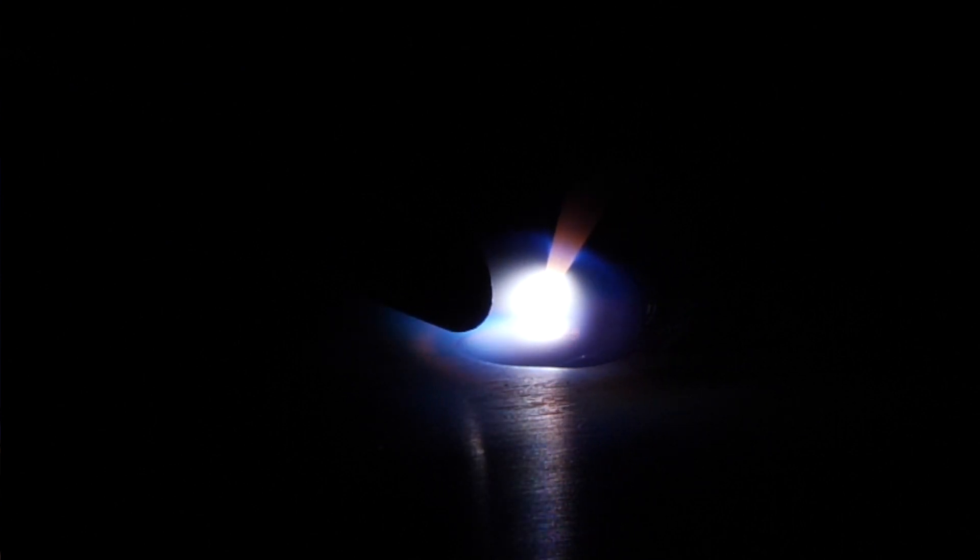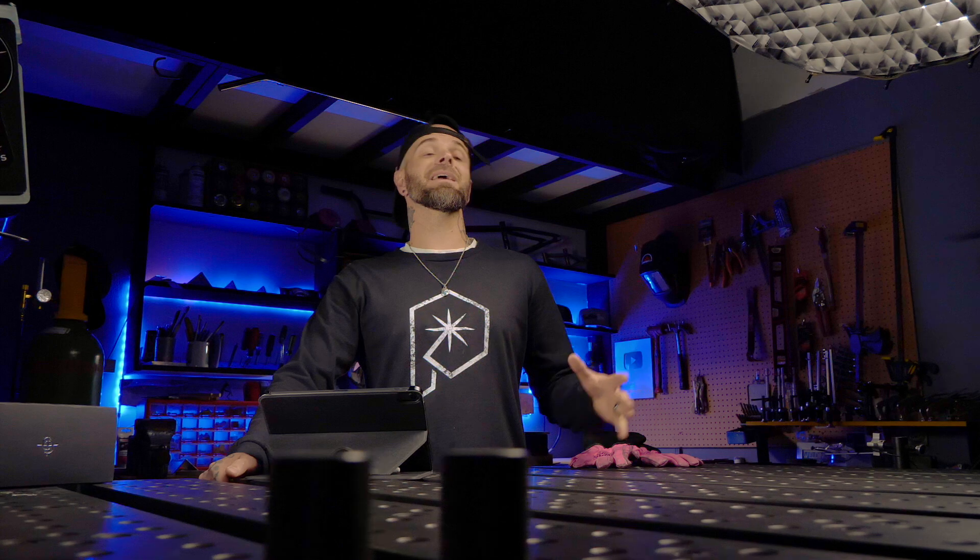If I take a few extra seconds for things to stabilize, but then once everything is good, I am good to go. What is typical is somebody's going to start up their pass, experience a little bit of turbulence, and the puddle is going to be wobbling all over the place. What is happening here is that this is a puddle that has not established properly before somebody tries to start moving it. All it takes is a little bit of extra time at the beginning and attention to detail — we want to make sure that the filler material settles down completely and the profile is exactly the size and shape we want before moving.